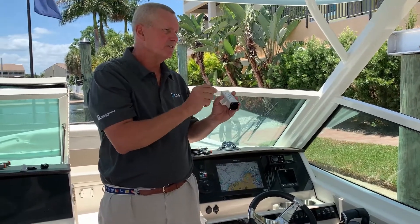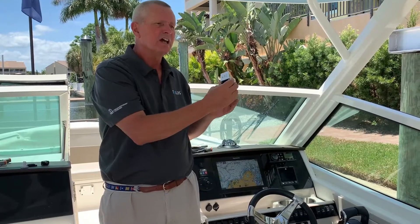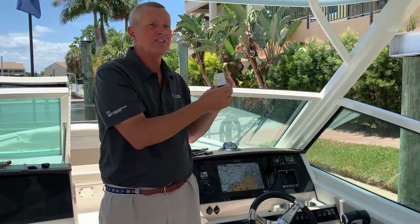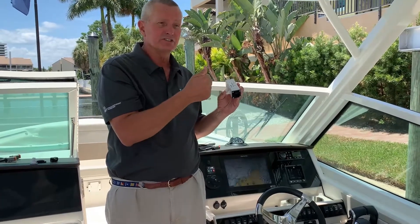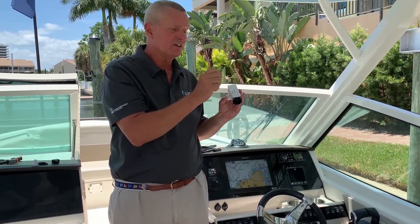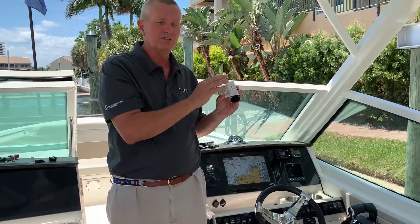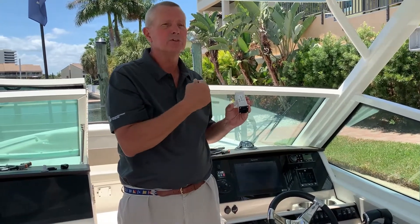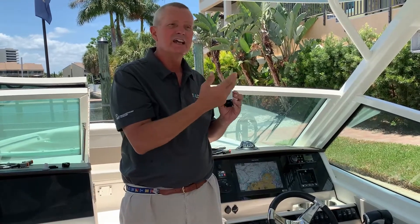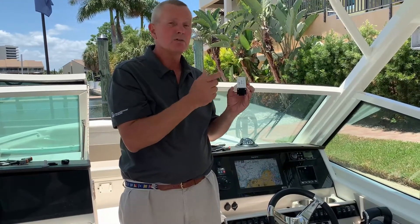You can actually power this up, connect your cables, and move it around to find the sweet spot for your particular application. If you do get a disturber, what you'll see on the indicator — especially with a clear or white housing — is it'll cycle green, blue, red three times in a row, indicating it's picking up a disturber and you need to relocate it.